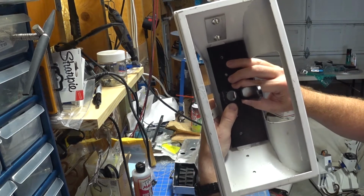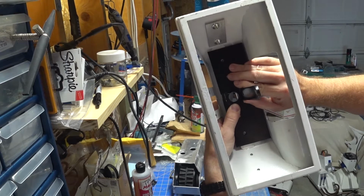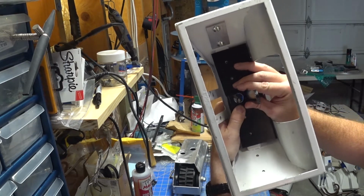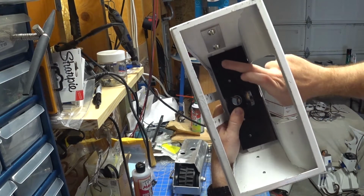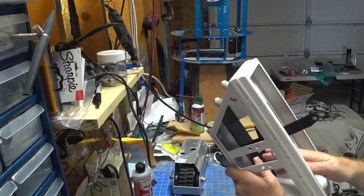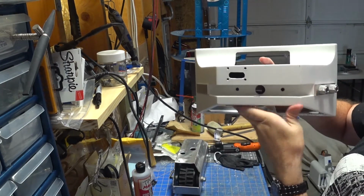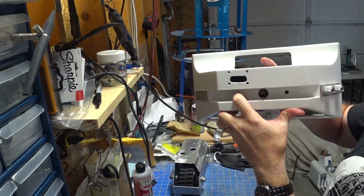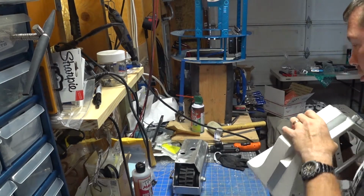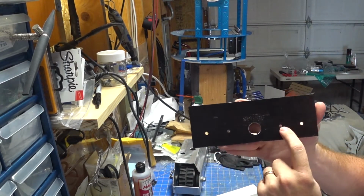This allowed me then to put a marker on the bottom of my ankle channel, at the top and the bottom. I apologize, the plate is shifting because I'm just holding it with my thumb. So I marked one here and here, and then I had it clamped in place so that when I flipped it over to this side channel, I could mark the bottom of the foot plate here and here, which corresponds to a marker hole there and on that one.